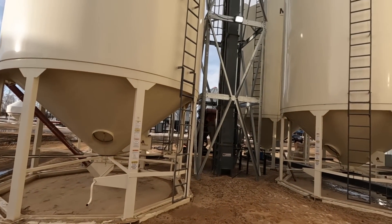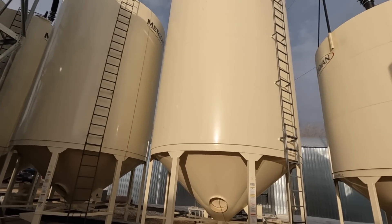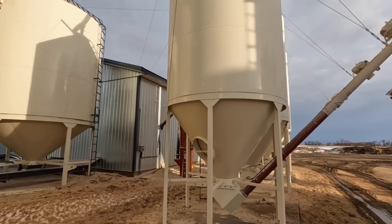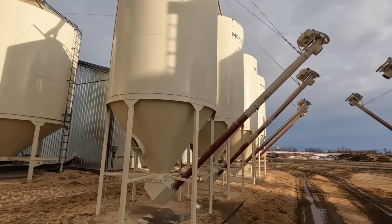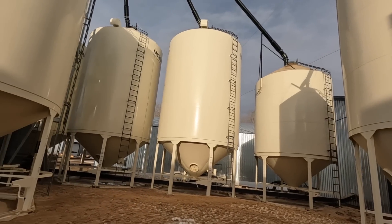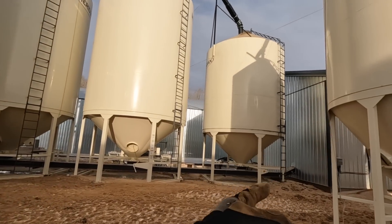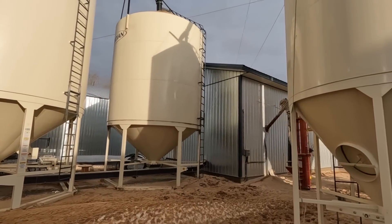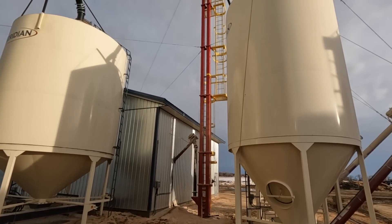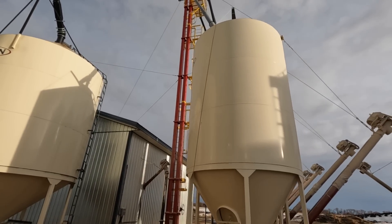All things considered, this thing is saving us some money by feeding oats instead of barley, and we're also feeding some screenings. A guy went and cleaned his grain for seed and we got the leftovers — makes good cow feed but you got to be able to feed it. The oats come into one of these bins from the drag, go into the hammer mill, then into the red grain leg and into one of the storage bins. The problem we got this morning is the oats, once they're hammer milled and fill up the bin, they're not activating the auto shut-off.